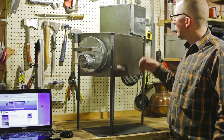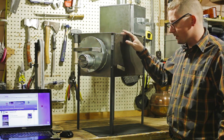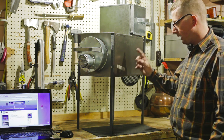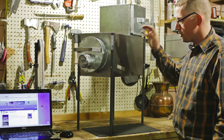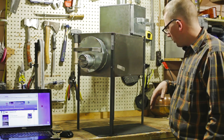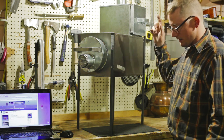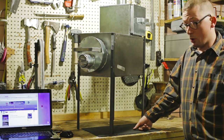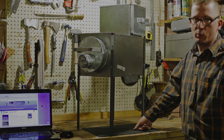And there it is. There's the finished stove. You know, made it from scratch out of sheet metal, 22 gauge and 26 gauge sheet metal with rivets, all just hand tools. I did use a drill and a Dremel tool to slice off some of the rivets here and there, but everything else is hammers, cold chisel, screwdriver, this sort of thing, just made with hand tools.